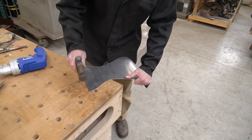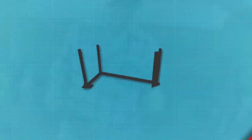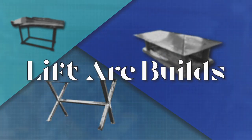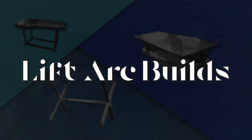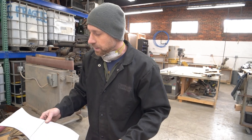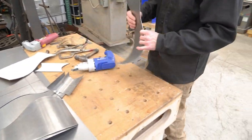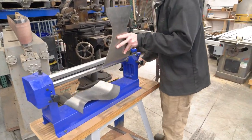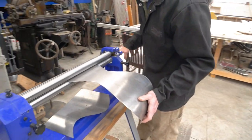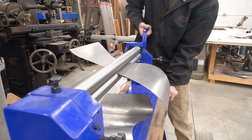We're halfway through the process of bending and making these rectangles. I made a cardboard template to fit the actual table base, then marked a line where it transitions from one curve to the other. I brought in the bottom curve up to that line, then I'm going to flip it over and do the top up to that line because that's where the curve changes.